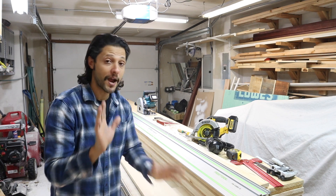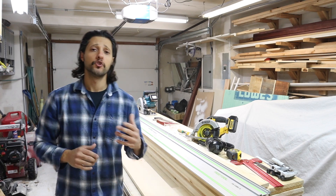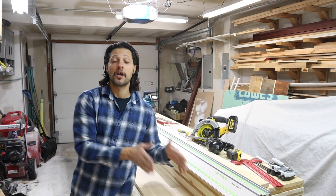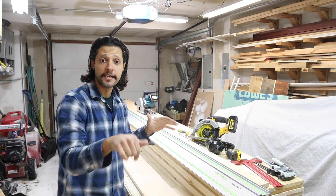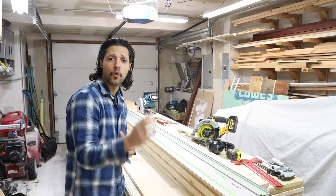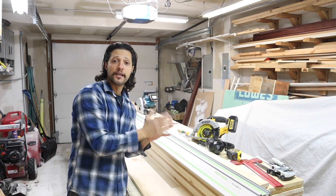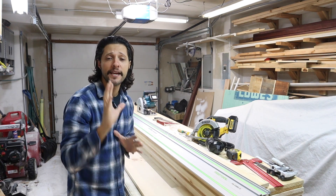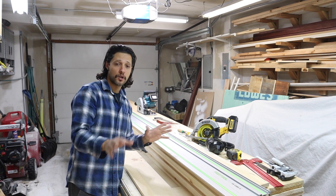For these boards, I don't have to worry much about surfacing the faces — I'll get into that when I talk about milling lumber, coming up soon. I'm going to be doing sliding barn doors made from scratch, starting with really thick boards, milling them, drying them out — I'll show that whole process. Right now, building these barn beams, the next step is using the router to make rabbets on the sides and join them that way — a nice strong, quick, easy joint with a perfect finish. All the tools I used are linked in the description box below — same price you'd pay anywhere, I just get a small Amazon commission at no extra cost to you.